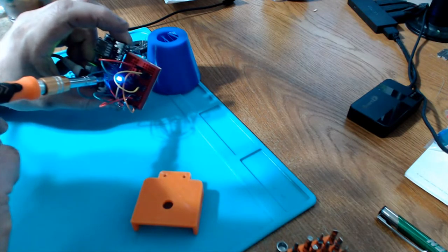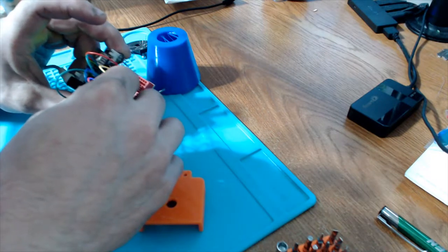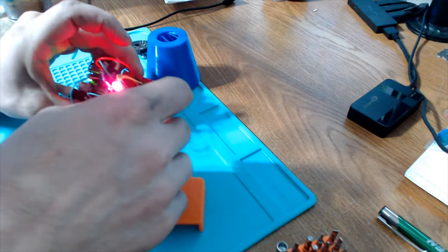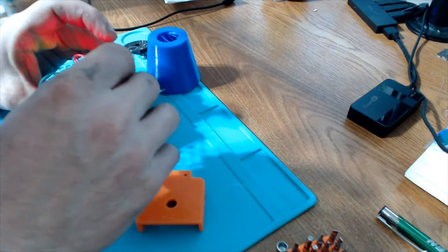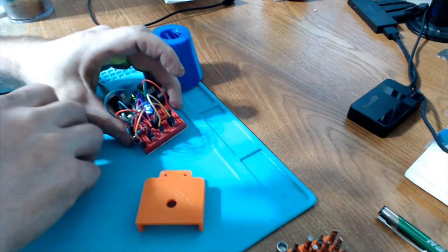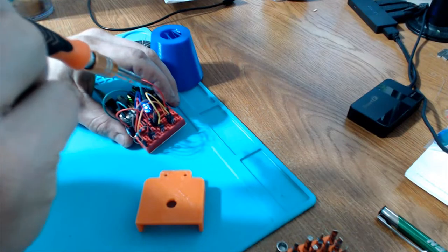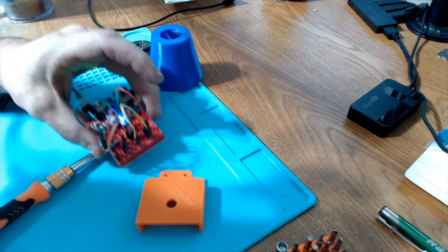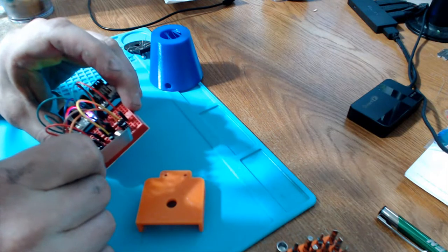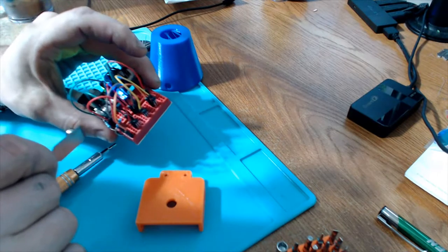As you can see the blue light is on. I put in a voltage divider. Without the red LED going through the voltage divider, you can see it goes bright red — its forward voltage seems to actually be a little less than two volts. The green LED is specified at three volts, just like the blue, but it seems more like 2.7 volts. Let me grab a magnet — there's the green one going through the voltage divider right now, and you can see it's still plenty bright enough.